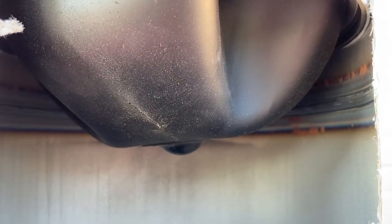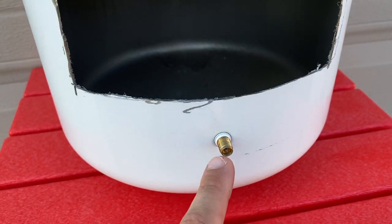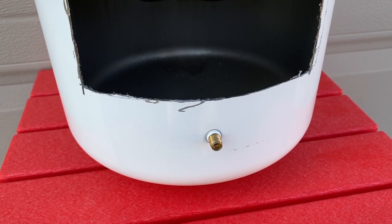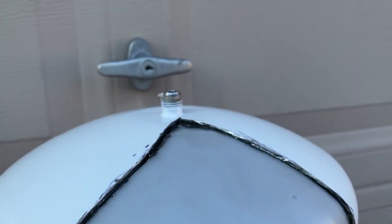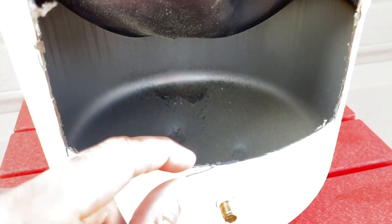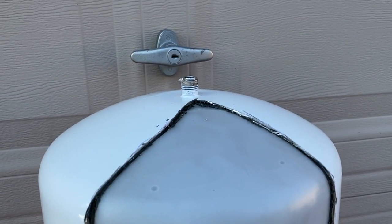There it is — the rubber internal bladder — and that is where all the water rests when it's inside the actual RO tank. This is your air pocket right here. What you do is fill that tank with air and the standard is between five to seven PSI. There are a couple of tanks that are more than that, however again standard is five to seven PSI. All of that air is inside this lower chamber of your tank, and when you open up your faucet, that air pocket pushes up on the bladder, pushing the water out of your tank through your lines and out of your faucet into your glass.